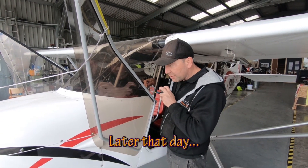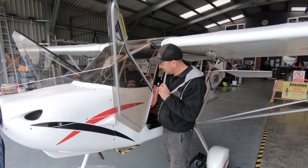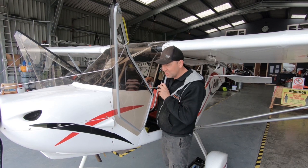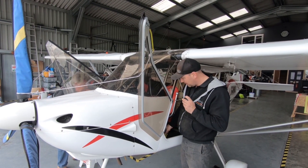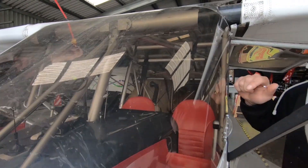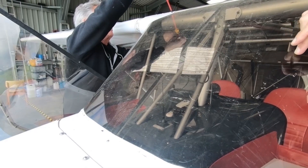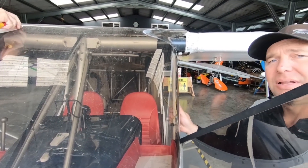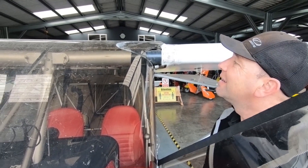We're doing engine work on this aircraft and trying to navigate it to a saleable condition. The owner wants the right money for it. The plane's just sat in a hangar for a while, hasn't really been flown as much as it should, and as a typical syndicate aircraft it probably hasn't been looked after cosmetically. If you look at the screen here, you can see all these surface scratches where the engine cowl has been dragged over it. Lexan isn't great for polishing out scratches, so for how much it will cost to change the screen, we're just going to rip it out — whoever buys it will have a brand new screen. You've got it splitting on the shoulder as well. Very common.